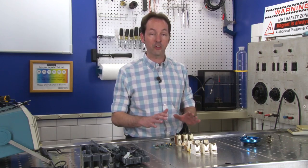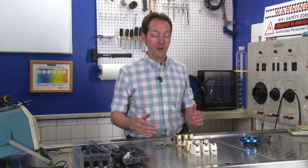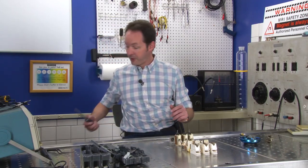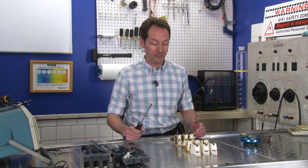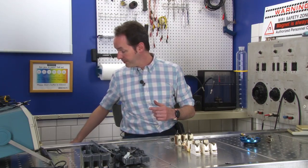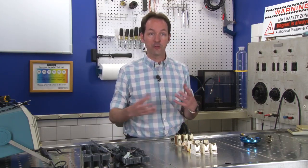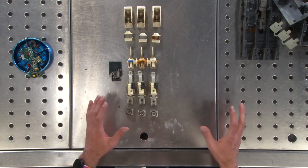And all this does is turn a switch off. That's it. It's a current-controlled switch with some twists. Because let's say you got Bob working on the line with his big screwdriver and he does a short phase-to-phase. Well, two things are going to happen. One, Bob's going to go blind and get screwdriver chunks in his face. Two, that screwdriver is going to create, quite literally, a crowbar load, which is how many amps can we suck out of the wall at once? This is a bad time. And this is how you light cable on fire really quick.